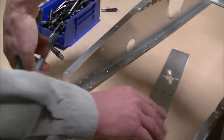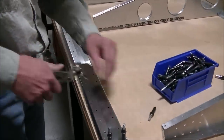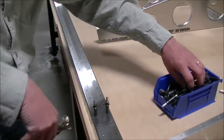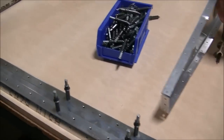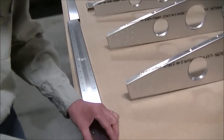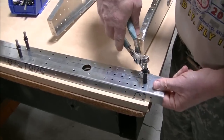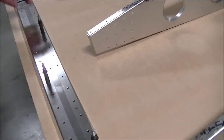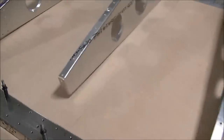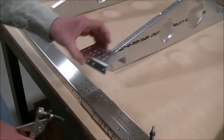Now we're going to work on the rear spars. These are the doublers for the rear spar and then we have a root end plate. You could go ahead and rivet your rear spar doublers all in place, but I've found that if you rivet before attaching to the ribs you might rivet in areas where you shouldn't be at this time. So I like to cleco the entire skeleton together first, take a good look at it, and then start riveting. Clecos are a wonderful tool to hold everything together before riveting. We have an inboard rear spar and an outboard one, spliced together with a joining piece.